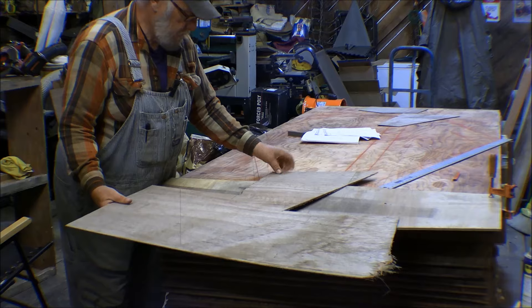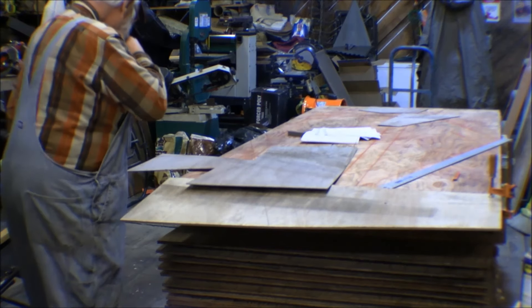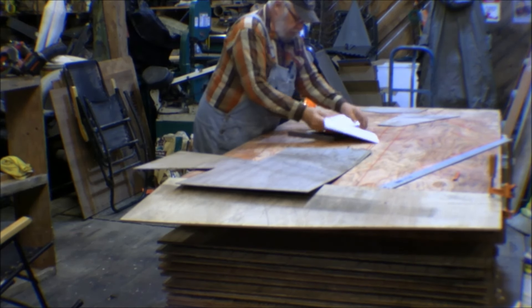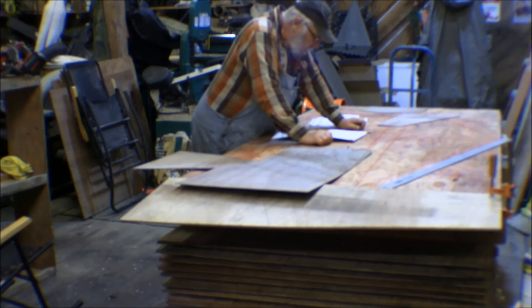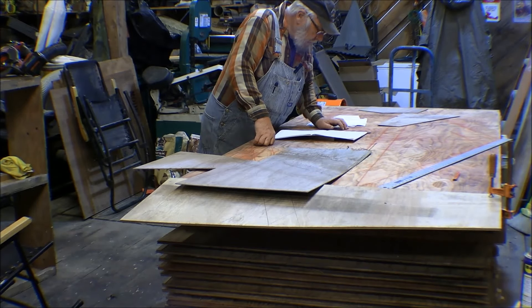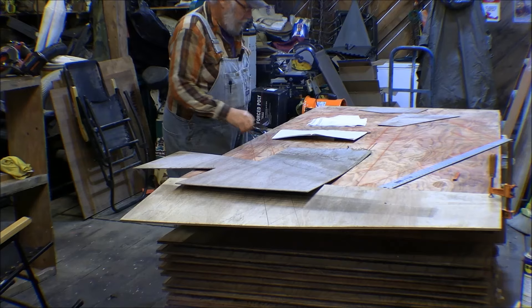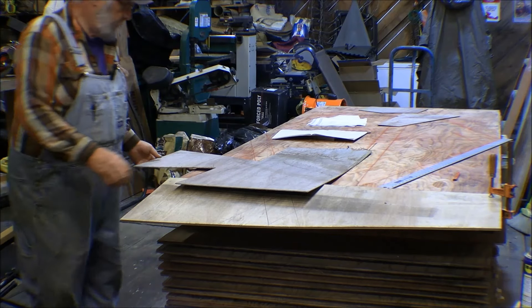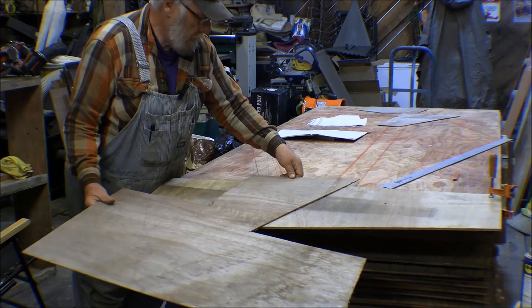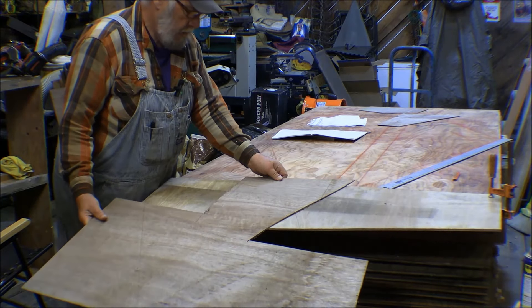The gusset needs at least 4 inches of material here. Looking at the diagram in the manual, they actually used just a square chunk of wood on the plans, calling for a 2x6 top cord, 2x4 bottom cord, and an 8x8 square. They don't even show a top gusset — they just show a lap 4 inches wide — but I'm going to make a gusset on that. All right, we're going to change things up a little bit. That'll work like that — I can overlay this out on the material I'm going to use to make the template.